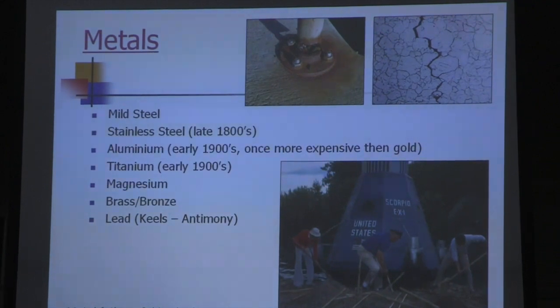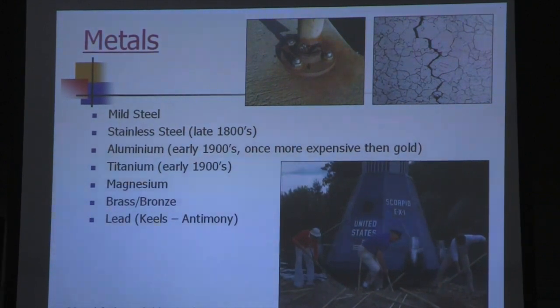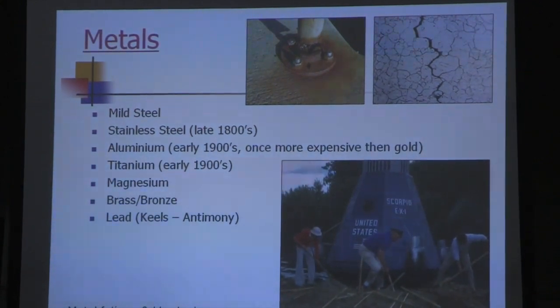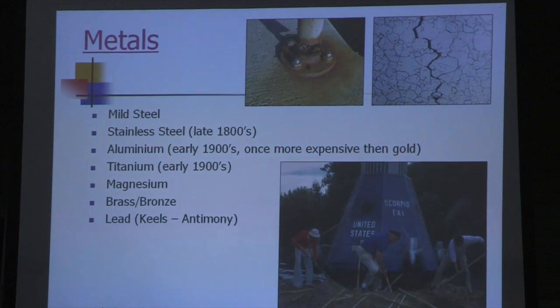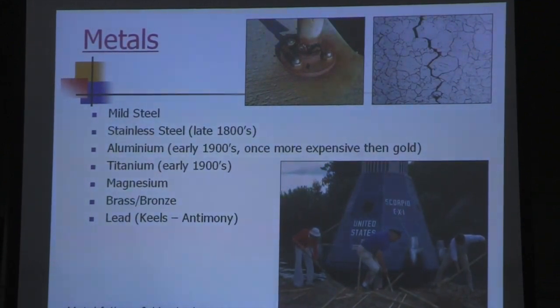That's rust, and that means that the oxide layer is being broken down, and that's usually from another metal washing onto it. So there's some metal somewhere, or whoever welded it might have ground it with a grinding wheel and then didn't clean it. There could be something zinc higher up, and when the water washes down, it gets zinc on it. It's a whole bunch of contaminants, but something is removing the oxide layer, allowing it to rust.